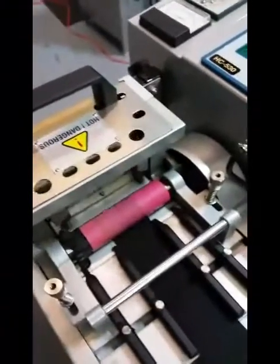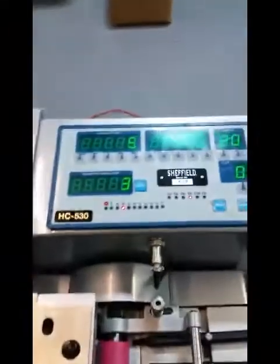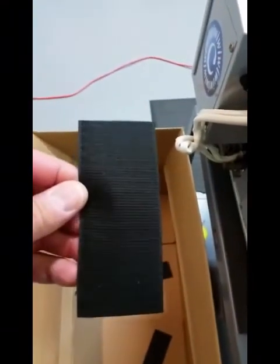and start button. And it will advance to, in this case we're cutting 5 inches, and we're going to cut 5 pieces total, and the machine will stop at 5. Blade stops, you get an indication that the material is finished, and you get your cut piece.